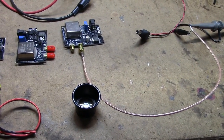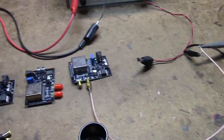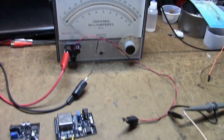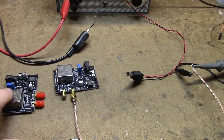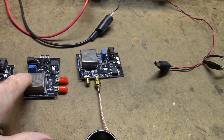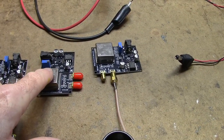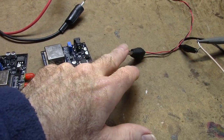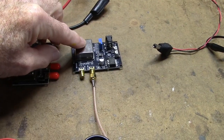I'm going to power these up from a bench supply. I've adjusted the output to seven volts and I'm going to monitor current through an ammeter. I imagine it's going to draw some heavy current to begin with because it's going to have to heat up the element. There's probably a solid-state device controlling the heat, likely a feedback system with a thermistor — all done inside the can. That'll drop the seven volts down to five for the actual OCXO module.